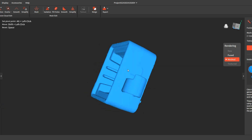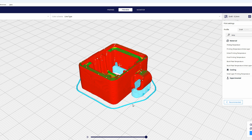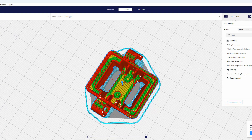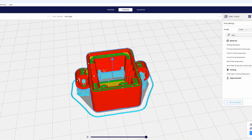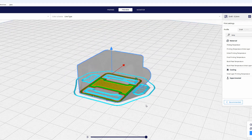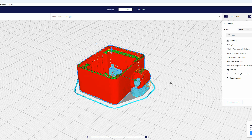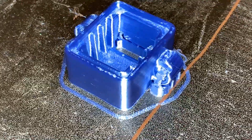This was my merged final one — you can see it looks pretty good. Then I went ahead and put it on my slicer program. Here it is getting ready to be sliced and diced. You can see all these blue pieces are support pieces that I'll have to pull off — supports here to hold up the spots, supports here to hold up the holes. It's 91 slices total. As you go down you can see how it's all sliced — each one is another layer of plastic. It lays down the first layer, then the second, then goes up three, four, five all the way until it builds the whole entire thing.